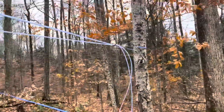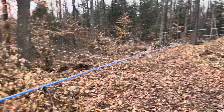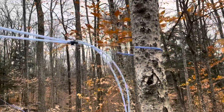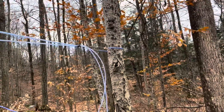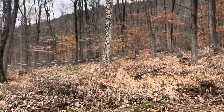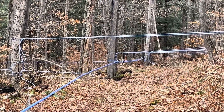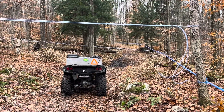Anyway, the reason I want to show you this: I was thinking how was I going to get tubing into the main line without having a bunch of tubing in the way. So I thought of this — I've done it before but not quite this extensively — just put a tie-back wire up and hook your runs into that. You've got to think a little different with tubing because you're going to tube to one spot instead of in a straight line. It's kind of a dead spot right here as far as trees go. You can see the ones I already did over here — two runs there, four runs there, and the furthest one has six runs coming into it. Not bad, coming out okay.